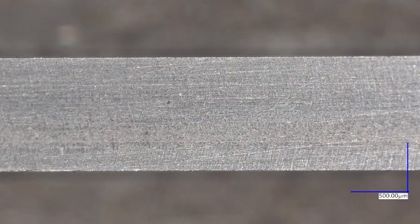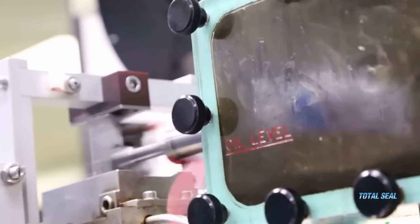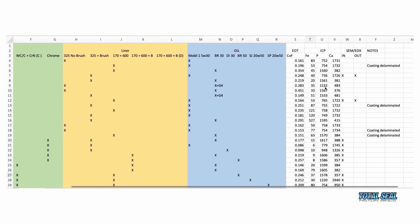We're going to show you the pictures in a few minutes of all the different variables, because our test matrix got silly. We varied surface finish from fairly rough surfaces to fairly smooth surfaces, coatings — going from an uncoated ring to different coatings of rings and then two layers of coating — and we've also got something special for you later. And then we also ran different oils, because it's running in a bath of oil. We've analyzed all those oils and measured all the surfaces so we can see the wear.